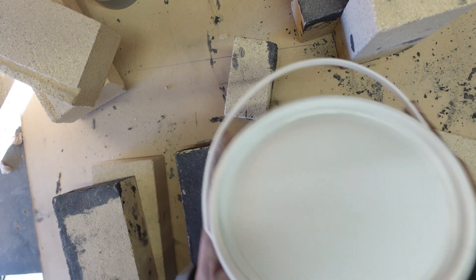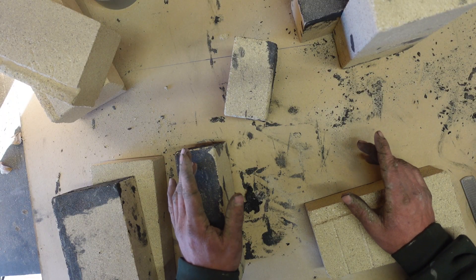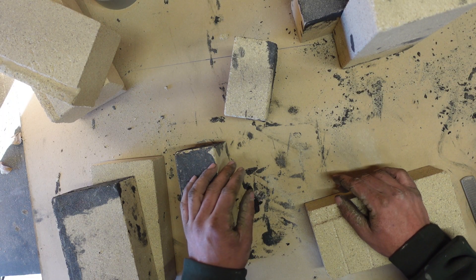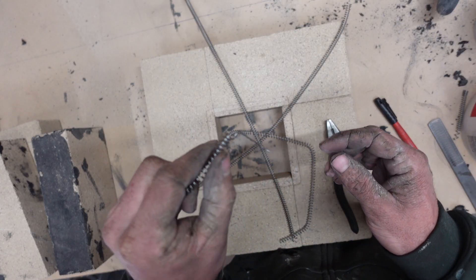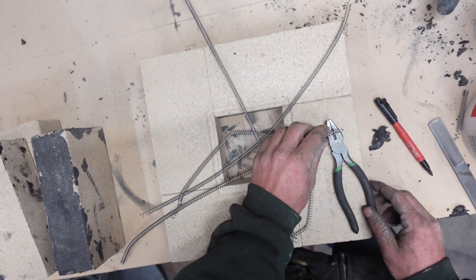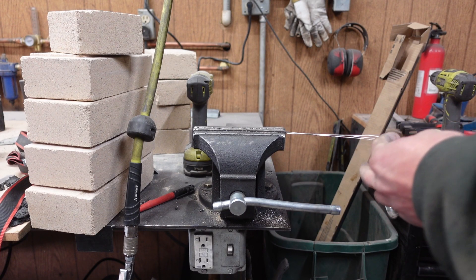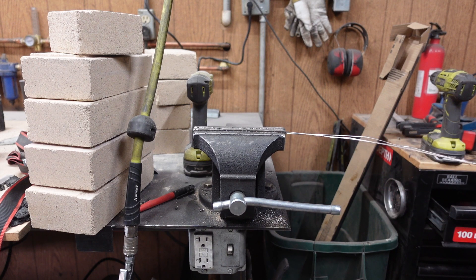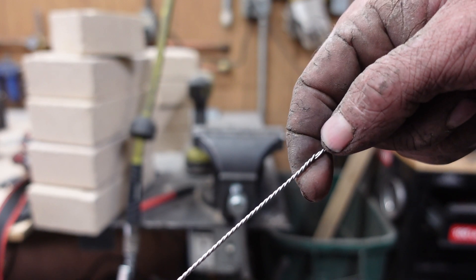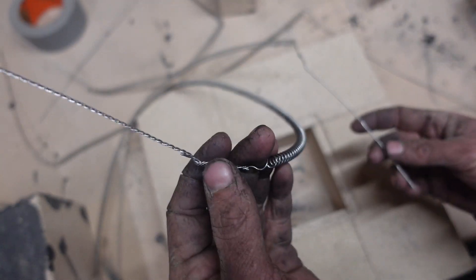Here we are a week later. Finally got the right stuff, and I think it's worth preparing the wires before actually assembling this thing. To hook these coils up to the electricity, I'm bending a straight section at 90 degrees and then I'm gonna stitch on some nichrome wire. In order to make sure these little extensions are as little resistive as possible, I'm just gonna twist together three of them and then stitch them on to our coils. That took much longer than expected but I got all my coils with little danglers on the end.